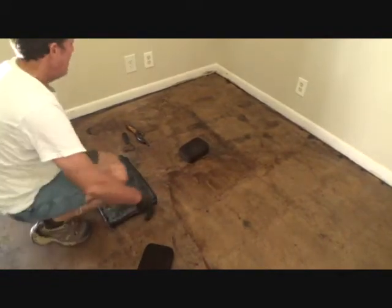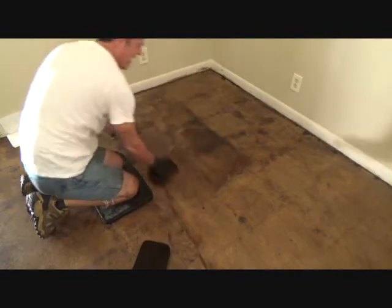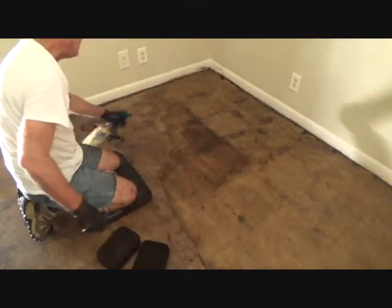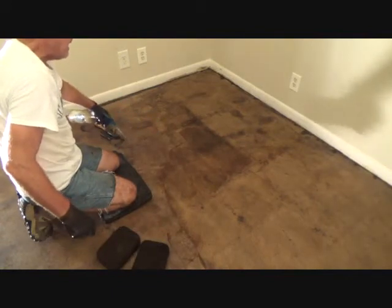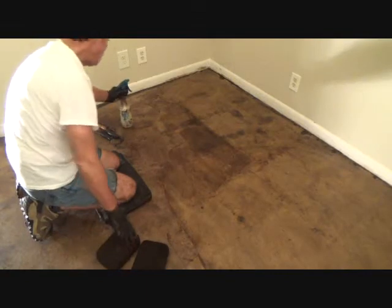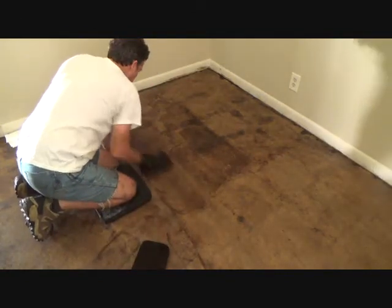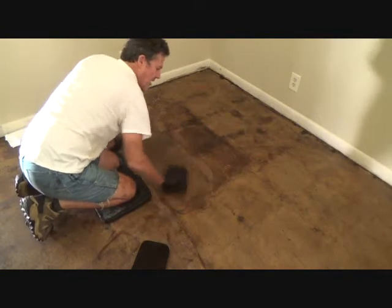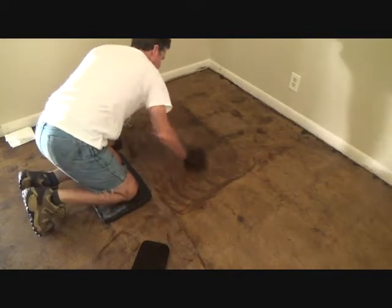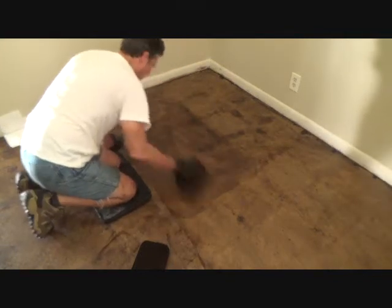You know, if this was a brand new subfloor and you want everything to look almost the same, what you could do is put your stain in a Hudson sprayer and spray it on. Once you do that, once you start, you've got to keep going though. You can't just wipe that up with a rag later, an oopsie, or whatever. Once you start, you keep going. So you'd have to have your whole job ready for that.